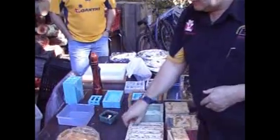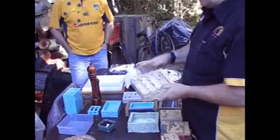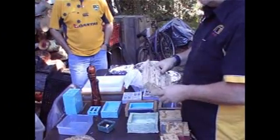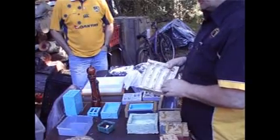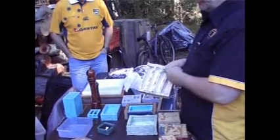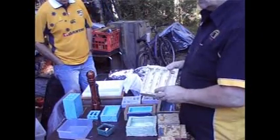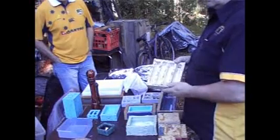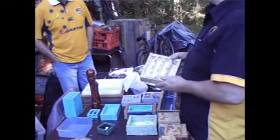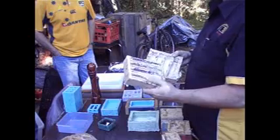I then went to pour my own silicone. Barnes has a few products, and likewise Fiberglass International. Again, I've done this so that there's the blank size in the bottom and then a well size for extra resin, so that under pressure it'll soak in. I've done these individually, so I can cast 1 or 4. That one I tried going a bit thinner on the resin, but I find that flexes too much.